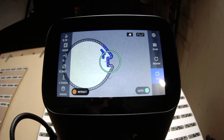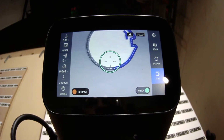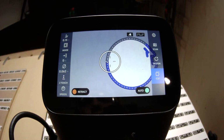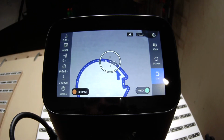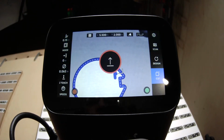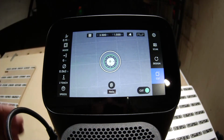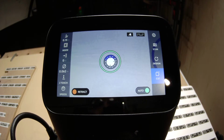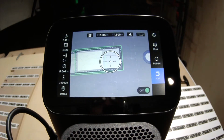And so I see Sam's got a cutter. I didn't have the 16th inch cutter. I used the 8th inch cutter that comes with Origin. It was fine for these parts, but it's not quite as nice for cutting plastic like this. I did do 2 passes in order to not get any melting. You want to run the spindle nice and low speed. This is on a 1, and that keeps the plastic from melting.